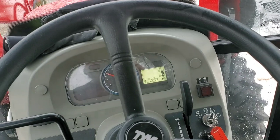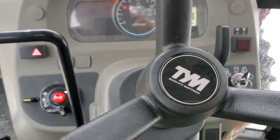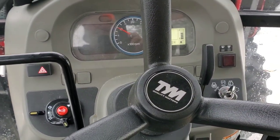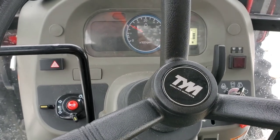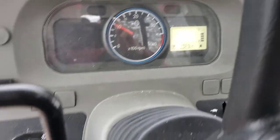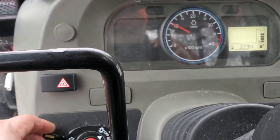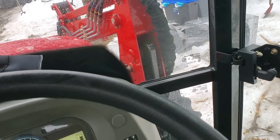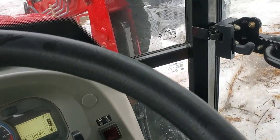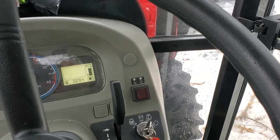It's freezing and snowing today but she lit right up — stone cold at 102.9 hours on the clock, basically 50 hours per season, though this season it's more like 70. The headlight switch is easy to operate — daytime, high beams, off, horn, turn signals — so it is set up for pulling a big trailer with four-ways. The PTO in automatic mode will shut off whenever you raise the three-point or step on the clutch; leave it in manual and it runs all the time.